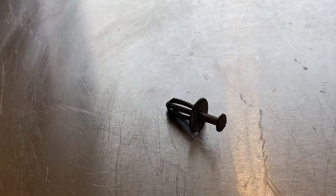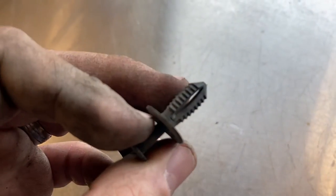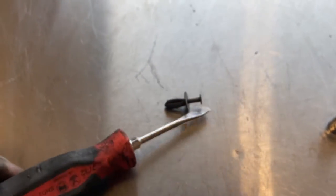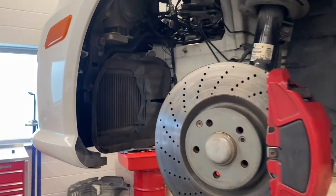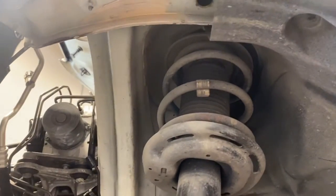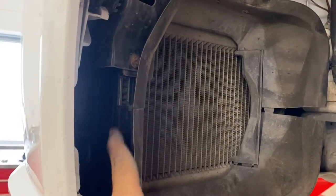Now these tabs are a little bit tricky — they're just made of plastic, and they're kind of hard to remove because you don't want to break them. They have veins that they stab in, and you can push the center in to force the veins to come out in order to remove them. You can use a plastic tool or a screwdriver just to get them started, and then the rest of the way you can use pliers gently to pull them out. Now I have the liner removed and the exchanger is easy to work with. There were four tabs in total and those 10mm bolts — that'll allow you to get to the heat exchanger shroud and the heat exchanger itself.